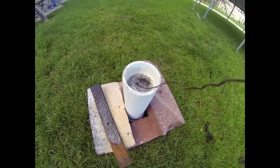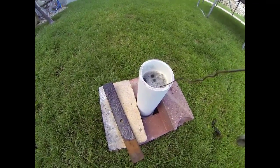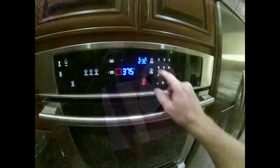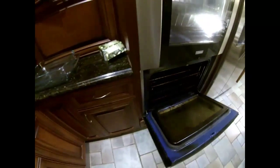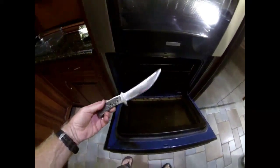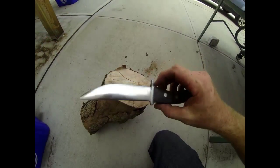So the last step in the process — after you take this knife blade blank out of the oil and let it cool — we want to put it back into an oven. In this case I'm just going to use my kitchen oven, about 375 degrees for at least 3 hours. This is the tempering process, and again we want to let it cool slowly. What I do is put it in for 3 hours and then let it cool in the oven overnight. This annealing and then hardening and then tempering process will give you a knife that is not only sharp but durable enough to last a lifetime.